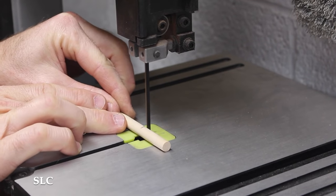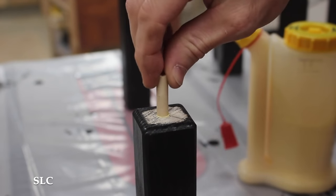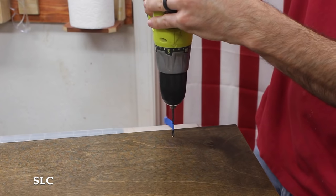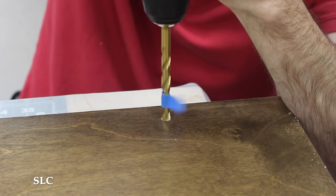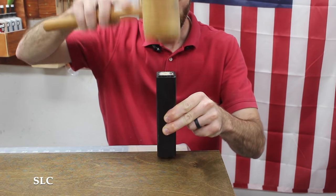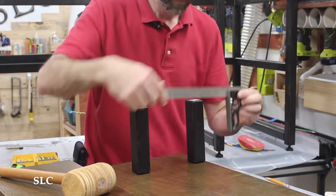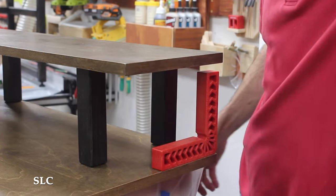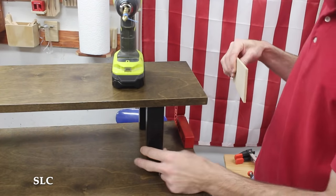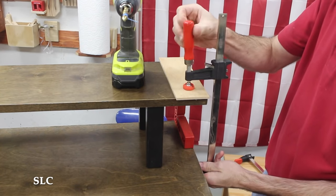I used the bandsaw to cut down several dowels to about 1-3/8 inches long. With a little glue to secure it in place, I hammered a dowel into the bottom of each piece. Using a combination square, I measured out the exact location for each pedestal, made a mark with the awl, and used a combination of different-sized bits to drill out the appropriate holes for the dowels. When I was first installing each pedestal, I did not add glue with the intention of it being removable — but that changed later. After all six were installed, we put the top shelf in place to check alignment, and using some corner squares in an upright position definitely helped.